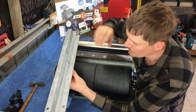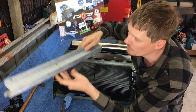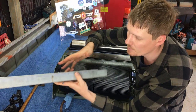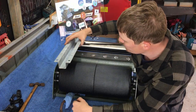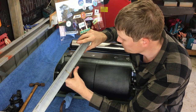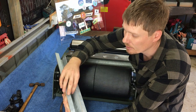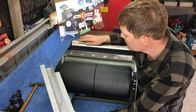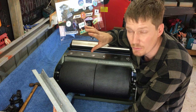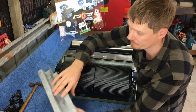The non-fixed side is the one that will be adjustable. If you get the position of the fixed side first and then match it to the other side - we'll get our height adjuster, place it across the rear roller and the front roller, and adjust our bolt until we're touching the top of the bed knife. Once we've done that, we'll reposition the height of cut bar to the opposite side and raise or lower that side of the roller until we're touching the same position, then tighten everything up and check again.